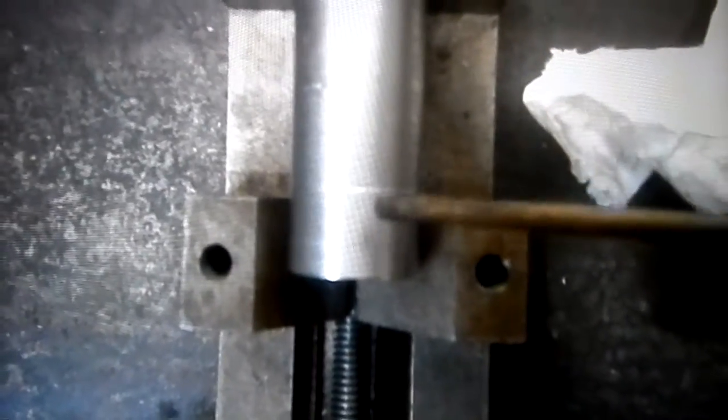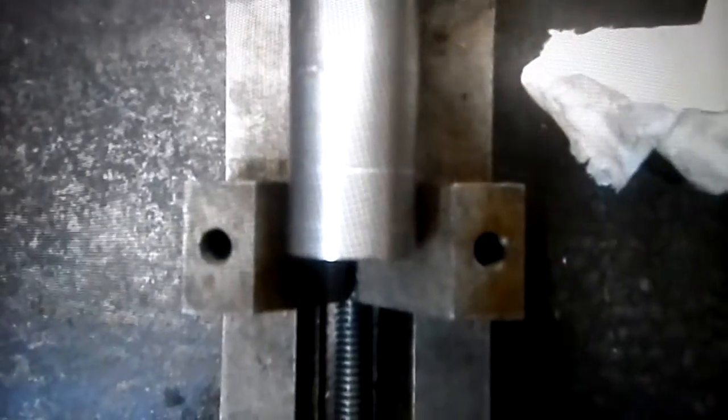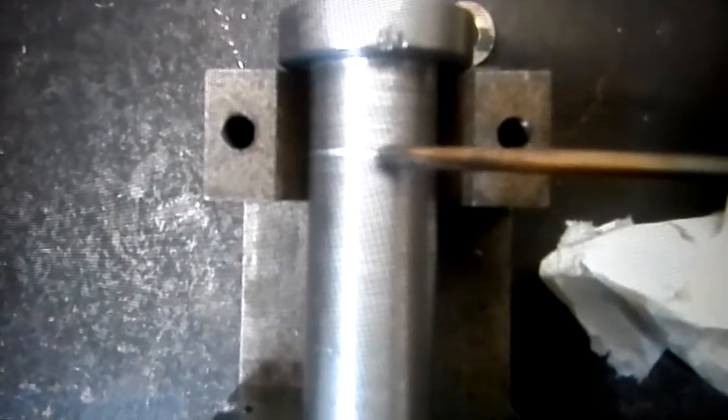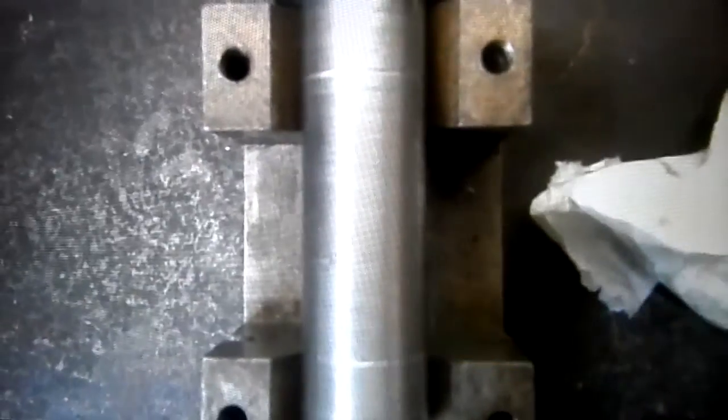This is the stop for the taper, and we'll have to get half the thickness from there for whatever size of a slot I'm going to mill, which will bring it to the edge of this down to this line. That is the length of the slot that's going to be milled in it. This is halfway between this, and this is going to be a 14 mil slot. So this is 7 mil, and I have it lined up. That's spot on there.